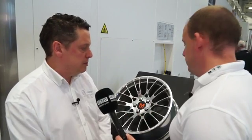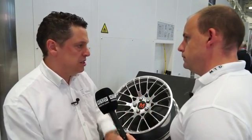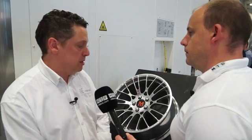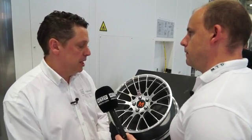Certainly, one of the things is that these particular pockets are quite deep with small radiuses in them. You could of course machine them in simultaneous, but what we're trying to do is use simultaneous for the positioning of the part, and then lock the machine in a 3+2 orientation so it's stable, and get the best performance out of the machine in that position. Then we go to another orientation, again simultaneously move to that position and run again.